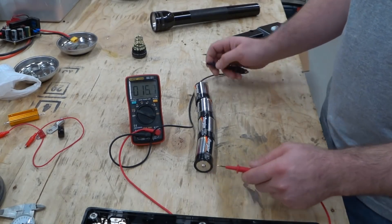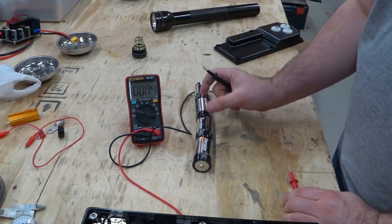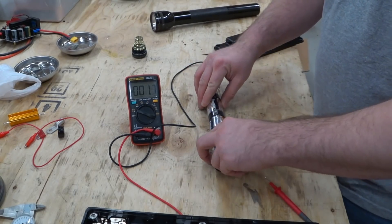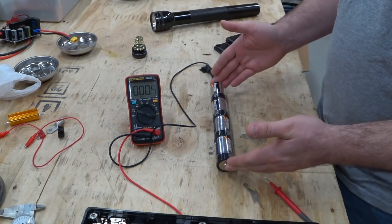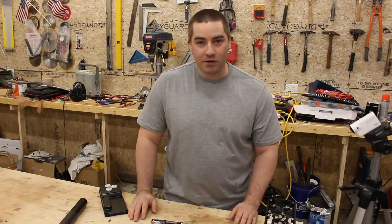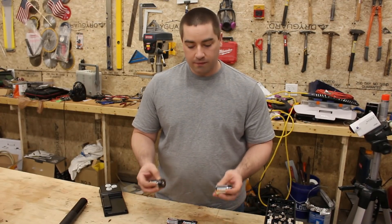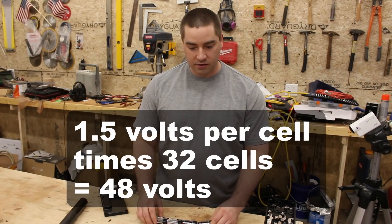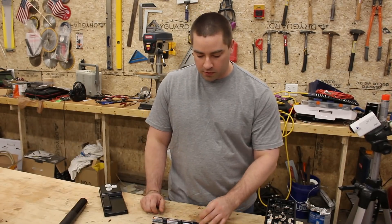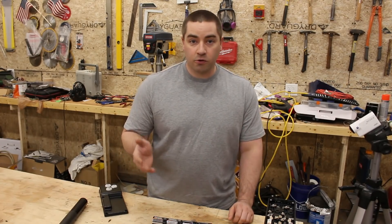What's happening is we're adding our voltages together. The first one is 1.5V, then 3, then 4.5V, and then finally 6V. So we add our voltages together when we put our cells in series. When we build our large DIY Powerwalls and off-grid systems, we're looking for 48V. That means we're going to need to string together something like 32 cells if we were using alkaline cells, or if you're using lead acid, you're going to be stringing together 24 cells.